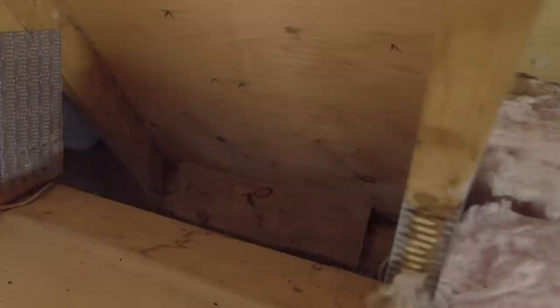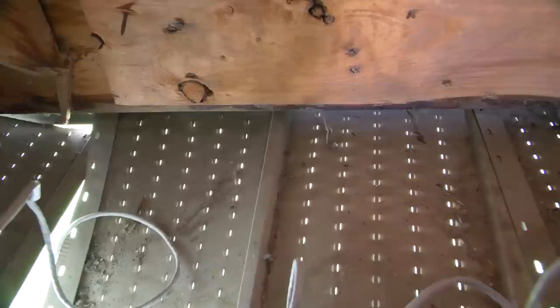The third camera to be installed is along the side of the house, right near a window. We'll run the cabling through the attic and along the soffit. The soffits are fully accessible from the attic by removing fiberglass insulation. The aluminum soffits can be gently dislodged from the tracks to allow the cabling to run along the edge of the soffit. Pull a reasonable amount of the CAT5E cable from the attic through the edge of the soffit, making sure you have an extra few feet of cable for adjustment purposes. Gently insert the cable along the edging of the soffit where there is a cavity inside the edge channel, and slowly move along the soffit until the desired location.